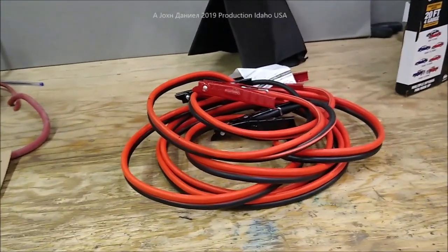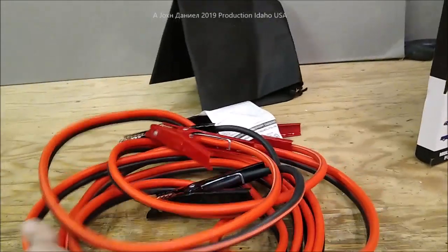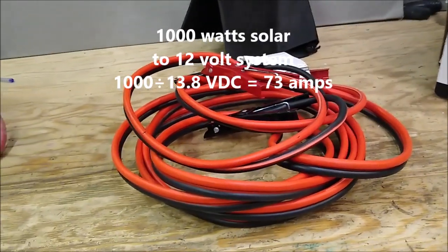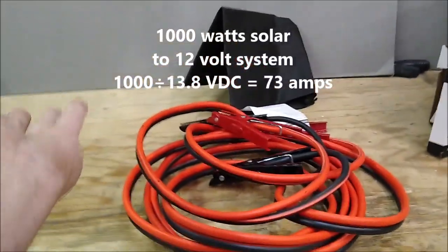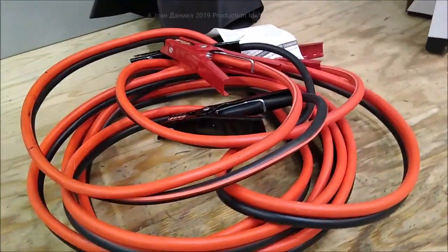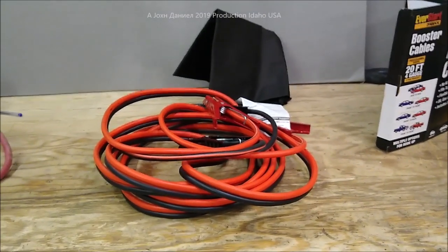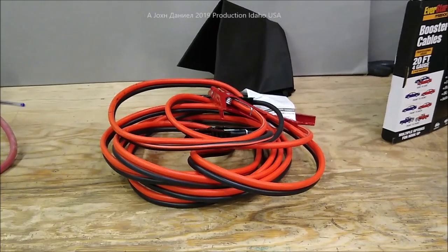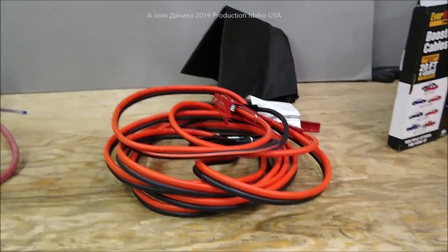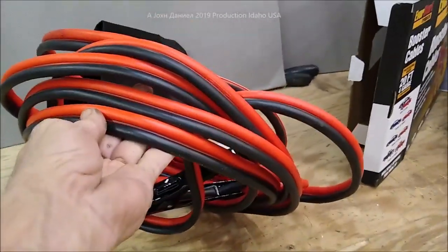Jerry — I'm calling you a clown, just like I did over there this morning. He thought he was going to run a 1,000-watt panel on four gauge. I told him four gauge is good for 105 amps, but he figured he'd buy some of this stuff because it claimed 300 amps. I don't want you all to make mistakes. I don't want somebody calling me up or posting saying 'man, I burnt my boat down' — and you can do that, believe it or not, right down to the water line.